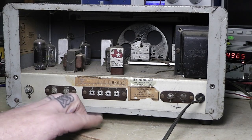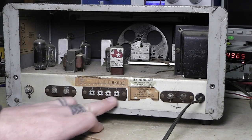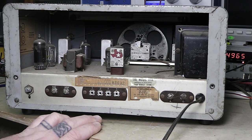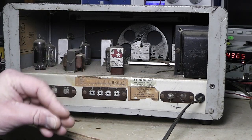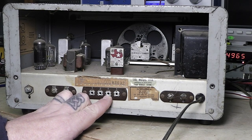And a lot of times, this one I've not looked at to see. Some of them you could actually, without having to put that switch in standby mode on the front, when you transmit, it will drop this out. Put it in standby. Which is fine for me, like if you're doing AM or sideband, of course, HT40. Like I said, I don't do the sideband, but if you key the mic, start talking. If you do a lot of CW, it's just closing, which gives you a CW break-in, but you hear a relay clicking all the time.